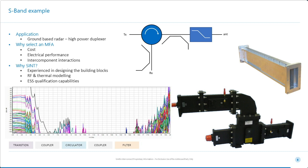Tony, do you want to expand on the electricals here? Sure, yeah. So the image here is a waveguide waffle iron filter to reject up to 6th harmonic. So it's double cascaded. So there's actually 2 waffle irons cascaded together. So that means we can take care of any return loss interactions, but also any potential phasing spikes in the stop band as well.